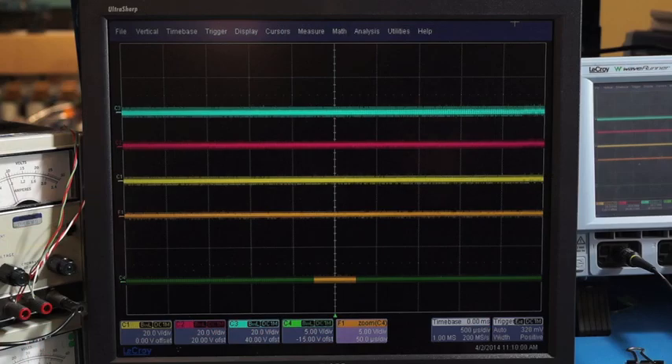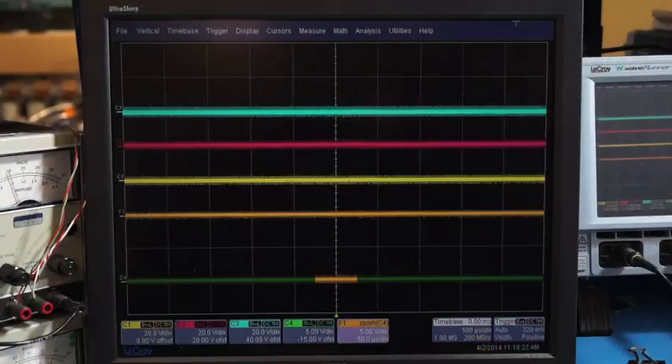The display of the oscilloscope is output to a PC monitor to better display the traces. Let's take a look at how the A4915 controls motor commutation. What we're showing here are the three output signals: channel 1 is the yellow trace, the red trace is channel 2, the blue trace is channel 3. These are outputs SA, SB, and SC respectively.